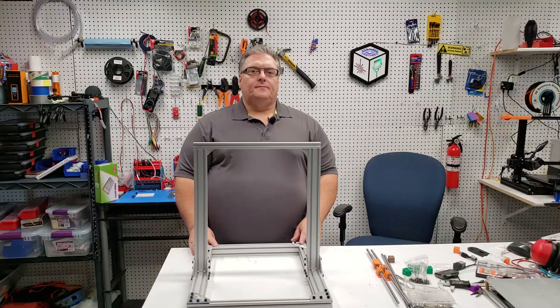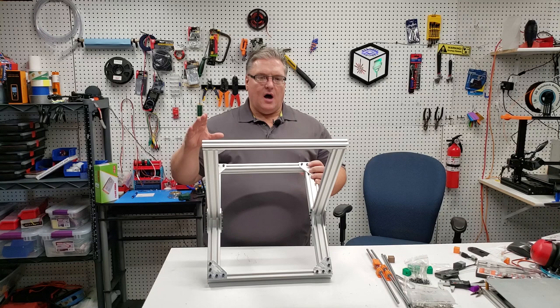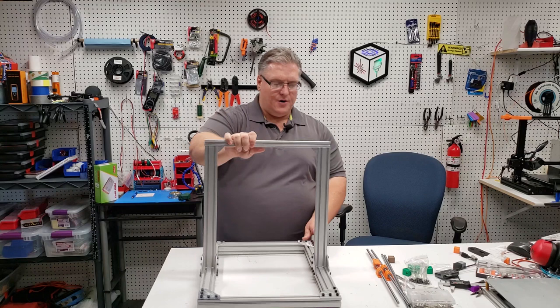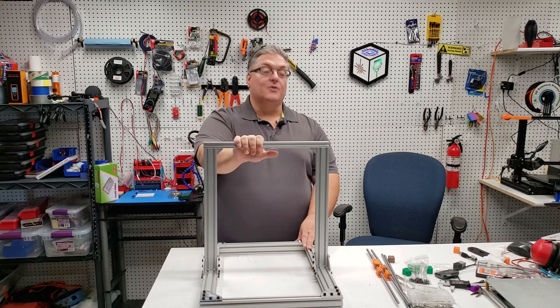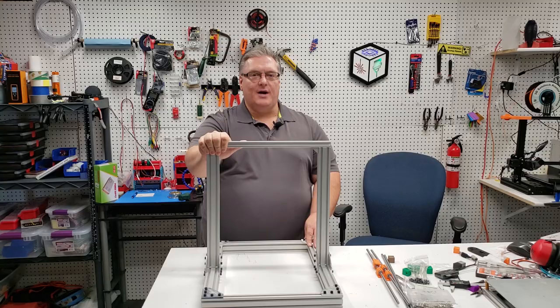At this point you should have the entire frame built. We used all of our corner brackets, which we made ourselves. We've used M5 screws to put everything together. We have our top bar on here — 40-40 down below, 20-40 for the uprights, and the crossbar here is 20-20. This is a solid printer — a lot of different printers out there, acrylic or otherwise, I guarantee you couldn't apply this sort of stress to. We have a solid frame, and we're going to continue on with the next steps.